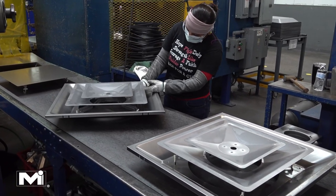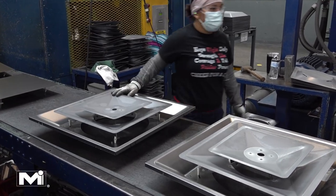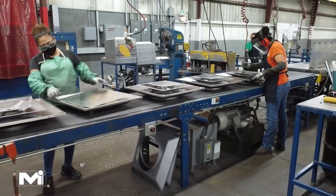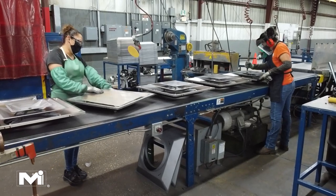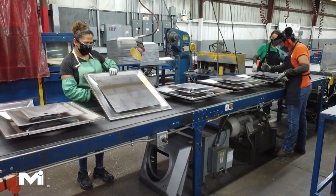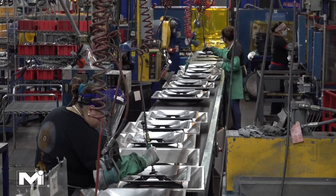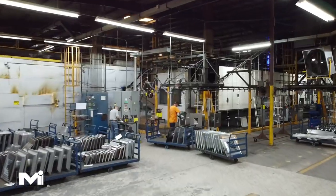The finished cores transport further down the line until they are met with a finished back pan. Workers help to assemble the 5700 by hooking the top of all four legs into four respective slots in the back pan. Once the core is installed, the latches are rotated, which locks the core and creates a finished but unpainted 5700 diffuser.